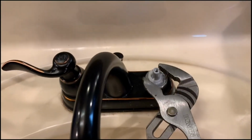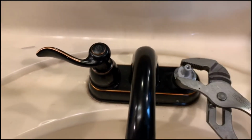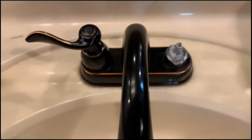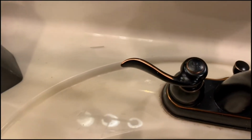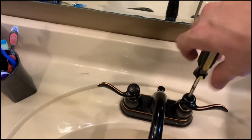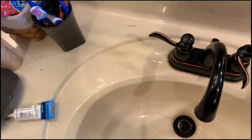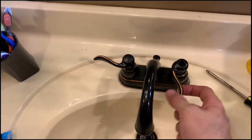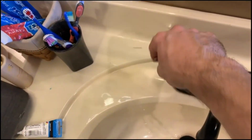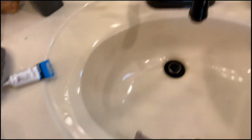Now we're going to take our channel locks here, and get that down there nice and tight. Put this piece back on. The screw's still inside there because we never took it out. Oh man, like butter. You would never know. Now it's going to make this other one seem bad, and she's going to make me redo it next. Put that little cap back on there, and then you've got to turn the water back on down here.